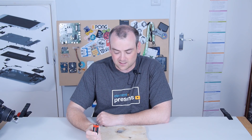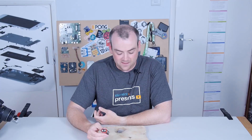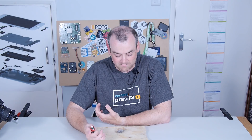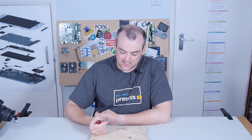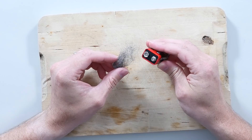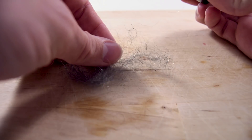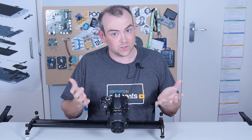The basic principle is that the physical cross-section of a conductor is what gives it its current carrying capacity. If your conductor is too small it's going to get hot and overheat and eventually melt. Now that's what you do with a fuse, and that's where most electrical protection started. With your 9V battery and just a little tiny tuft of wire wool, you can start finding contacts and burning it. It's reasonably safe — have a play. Don't burn your house down, don't burn your fingers. It gets hot.